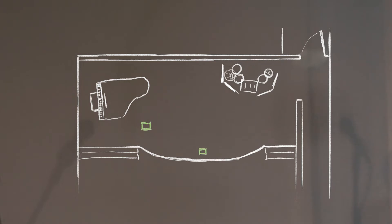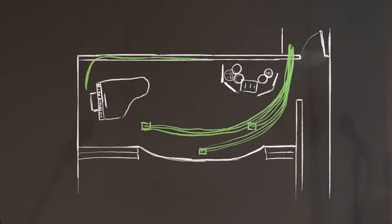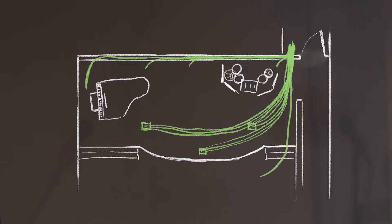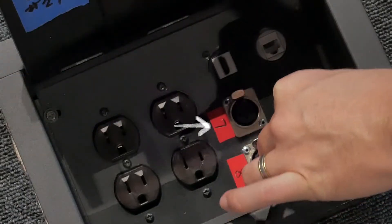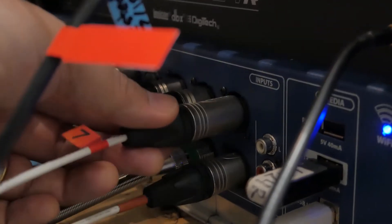Let's map out the signals from sources to speakers. On the platform, we have three stage boxes. Each of these has three female XLR connections that run under the platform and to the back room. We also have several other XLR cables hidden in a trough in the back of the platform, and one XLR cable run all the way to a room mic on the ceiling. Each cable is labeled on both ends with either a letter or a number, so you can say, okay, I plugged the guitar into number seven — the cable marked seven in the back room is carrying that signal and should be plugged into whatever channel on the mixer should get the guitar. The numbers and letters are just a way to keep track of the cables. We have more cables run than we have channels for on the mixer, to give us as many options as possible for where people need to be set up on stage.